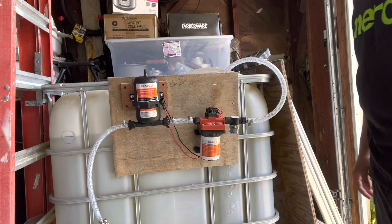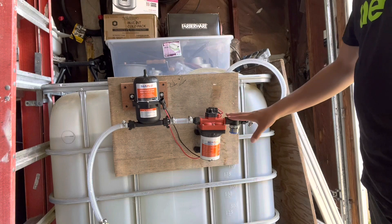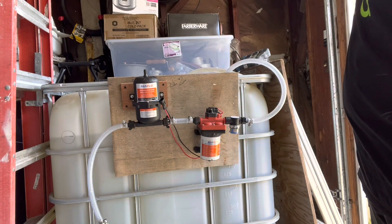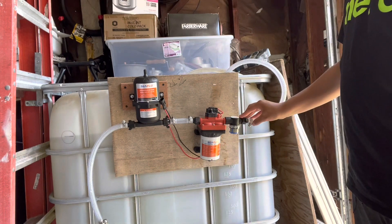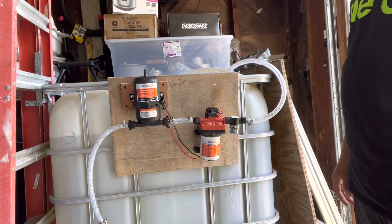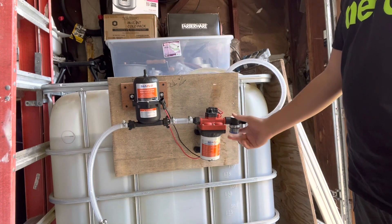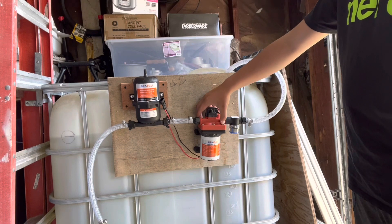So Alexi, what do we have here? You put this together, as far as I understand. This is basically what is back there — the reverse osmosis system for the house. We don't want to take that out, so we're showing you here in a cleaner copy of it. The first thing is a pre-filter and then a 12-volt automatic shutoff pump.